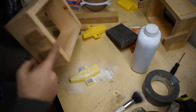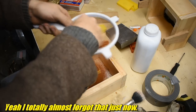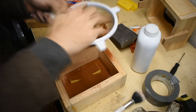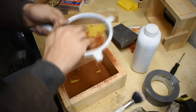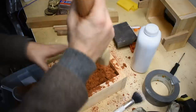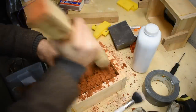Remember, parting surface down. I totally didn't almost forget that just now. The sand feels different in the cold. This is oil bonded sand. I know people tell me water bonded sand - the normal wet green sand - that stuff can freeze and you can't really use it when it's frozen. Wedding ring off, a little late in the game, but it's never too late to try to protect your marriage or your safety. Ruining your wedding ring is a danger to both.